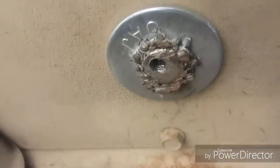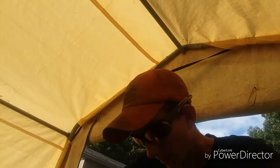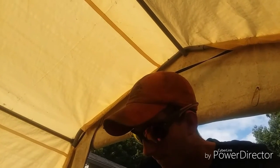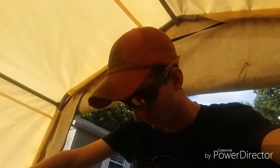that. Not particularly that, but do you see that weld? Now, there's nothing really wrong with that weld. It's just the fact that it's just stuck on there. It's not penetrating into the metal, which has been happening. But what's the matter is that my welder is not powerful enough to really put a good bead and weld something. And in order for me to put my shifting linkage on, I need something that will penetrate through that metal. And my little MIG Welder 80 will not do that.